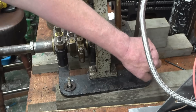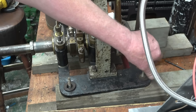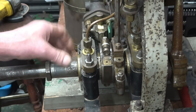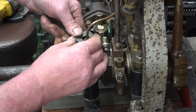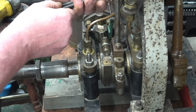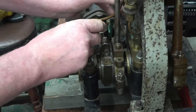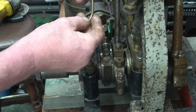I'll need a lift to get this off - I'll have to get my son to come and give us a hand. I'm going to have a little sneaky look under this and just see what sort of state the crankshaft's in. I'm just going to lift that main bearing journal off. Oil feed paper first. I think these oil feeders could have been put on as an extra - I don't think they're original, but I don't know. I haven't seen it in a photograph of this engine anyway.